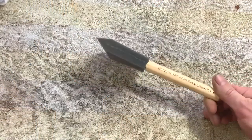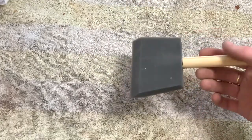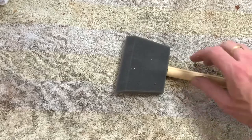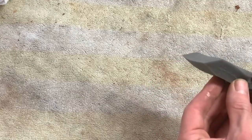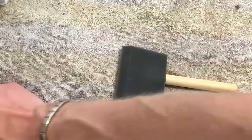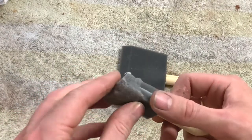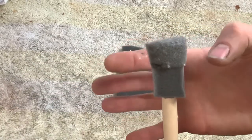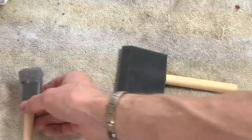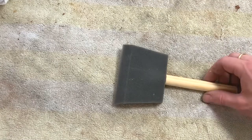So these are the brushes I use for applying the glue. They're called polybrushes or foam brushes — they're normally used for applying polyurethane, but they work well for this. You only get one use out of each section of it, so what I do is use it and then cut it off with scissors. It's got a plastic liner on the inside, so you have to cut that back too. You can get four or five uses off just one brush, and they're cheap anyway. They get a nice smooth coat off them.